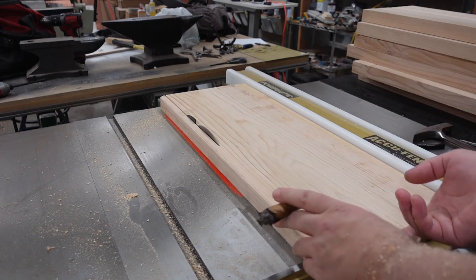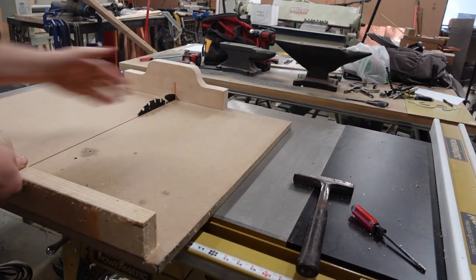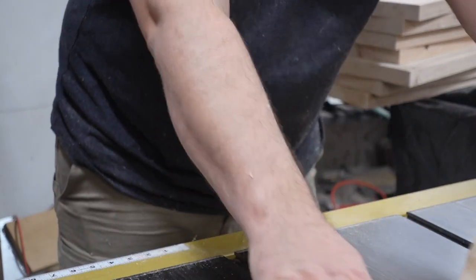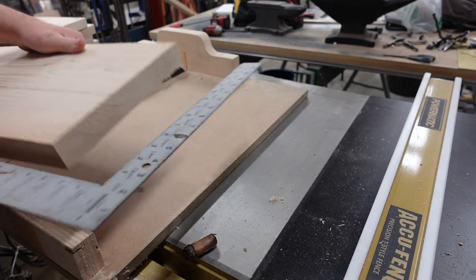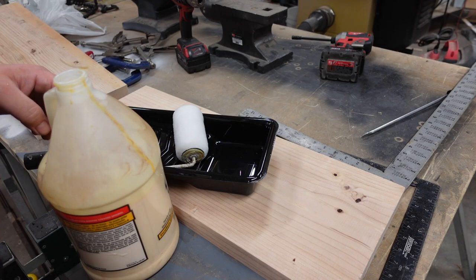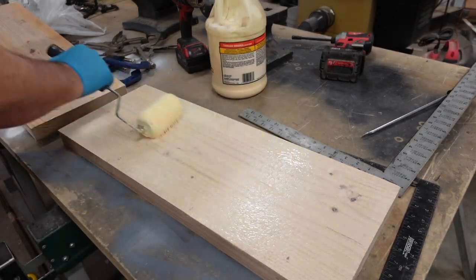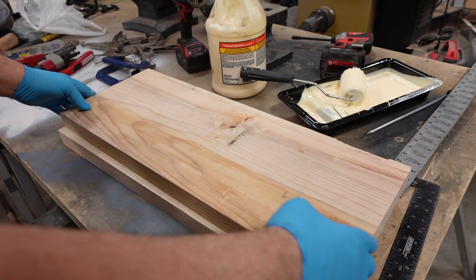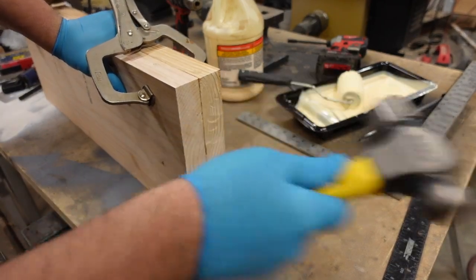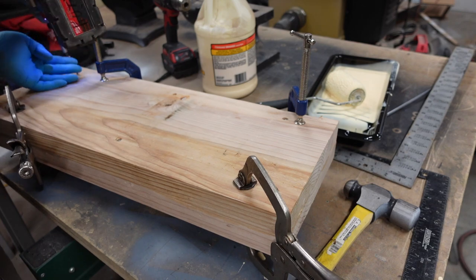Yours could be different. I'm cutting these boards to 27 inches and cutting the round corners off because I think it'll look better square. I rough-cut them with the miter saw and then do a final square-up after I rip them with the sled — it's a lot more accurate. I don't really use the miter saw as a final step; I think it's just better for rough cutting. I've got that Delta miter saw, just a 10-inch, but it cuts these 2x12s all the way through. Now I'm putting some regular wood glue on these and I'm going to screw them together.